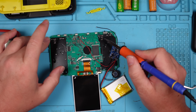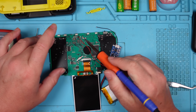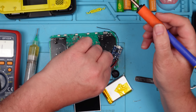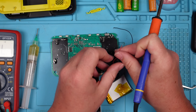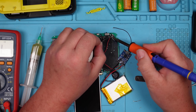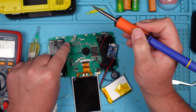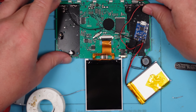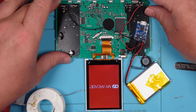I'm thinking about it. Just because it's expecting 6 volts here doesn't mean it's not going to work off 3.7 or whatever it is, because all it does is go to that point there anyway and get converted down. So let's take that off there and we'll put the positive to here, and then the negative to here. Well, the good news is that's not come on. So if I switch this now, is it going to come on? Yes, it is.